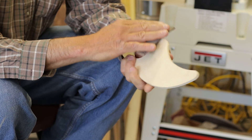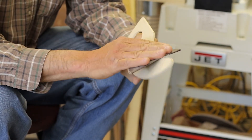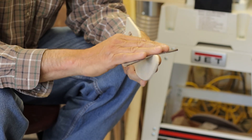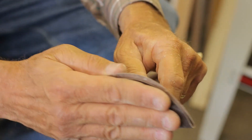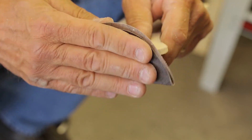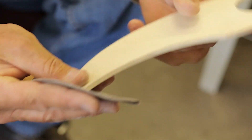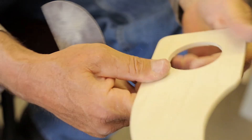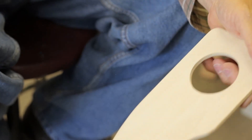Now I'm going to round over — or as they say in woodworking and cabinet making — soften the edges. Take off the little lumps that you didn't catch on the bigger sanders. All of that is done by hand and it gives the piece a really nice look and feel so you don't feel any corners anywhere. You've got to do the same thing here too.